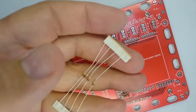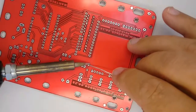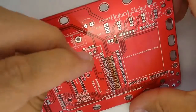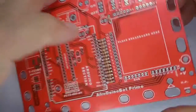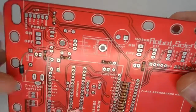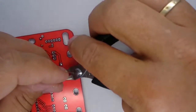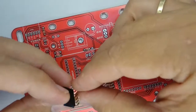Now you can place the 1 kilo ohm resistors and the 10 kilo ohm resistor on the printed circuit board. The 1 kilo ohm resistor can be identified by looking for resistors with brown, black, red, and gold stripes. The 10 kilo ohm resistor has brown, black, orange, and gold stripes. The diode is a small black cylindrical part with a lead out of each end — it is critical that the white strip on the silk screen and the silver band on the body of the diode are inserted the same way around.